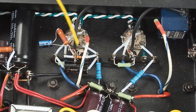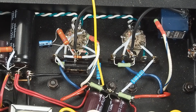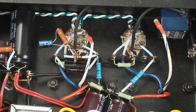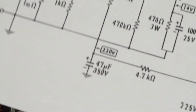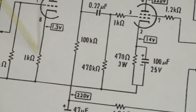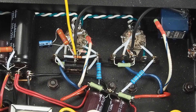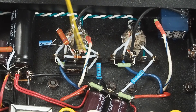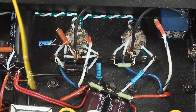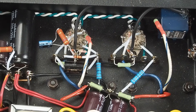The next component we added was the little cathode resistor right there — that's the cathode resistor for the input section of the triode. These two pins are fairly easy to get to if I wanted to play with putting a diode across there, or pull these over to try a rechargeable battery or some other things for doing the bias on the input tube.